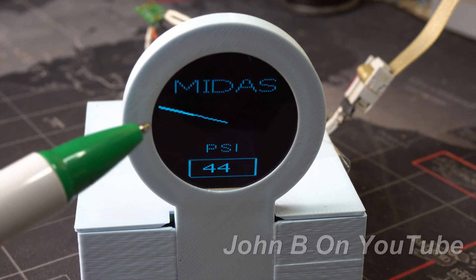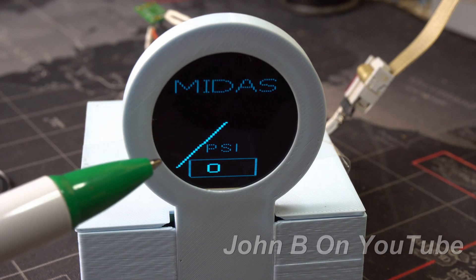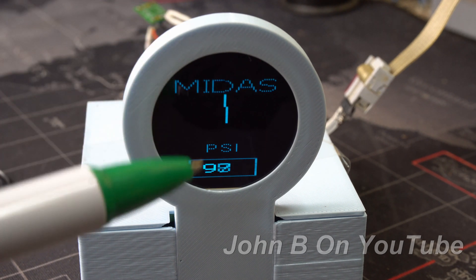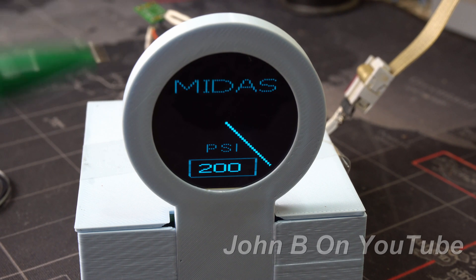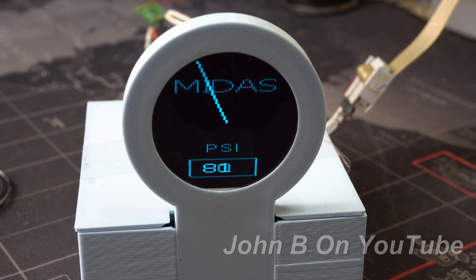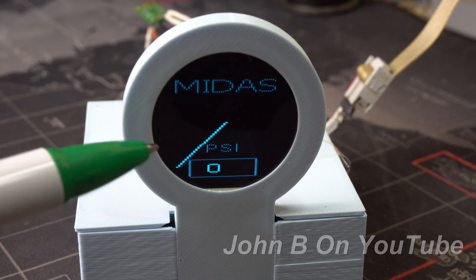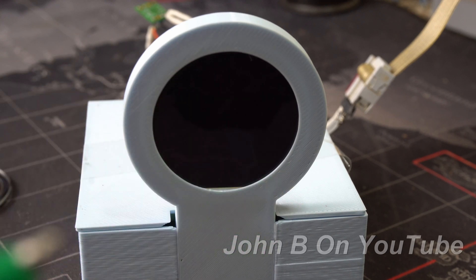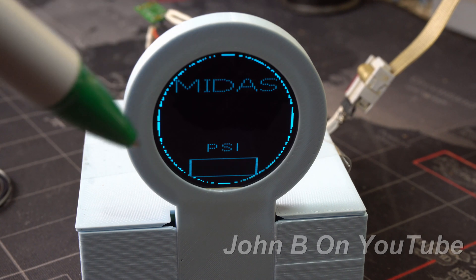You will have seen this code before on the color TFTs. I've got a small delay in there so you can actually see the needle pointing, because we're dealing with fractions of four decimal places — it actually takes a lot of computing to get this needle to sweep smoothly. If you connect this to an ADC it's super fast, quicker than the eye can follow. That's the blue on black, obviously simulating a sort of pressure gauge. Being a round display you can also play about with dots on the circumference — though we don't get all the pixels filled immediately because the rotating dot doesn't always fall on the place of a pixel.